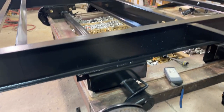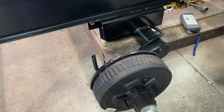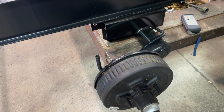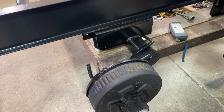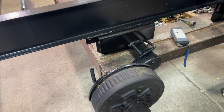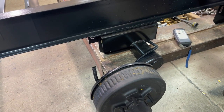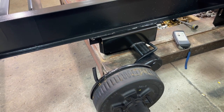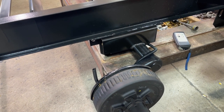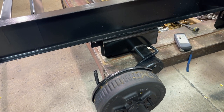It's a lot less maintenance too. On the leaf spring you have to change shackles every so often. We hear people mentioning that we have the Dexter Axle — they bring that up in other big ways. It's a big deal. When you hit those potholes, one wheel's going to go in and one's going to stay on the road rather than getting that bouncing effect, so it all works out better.